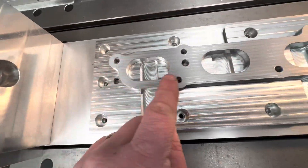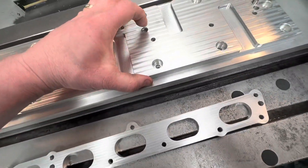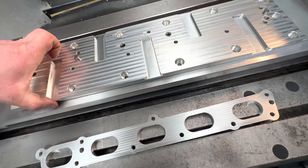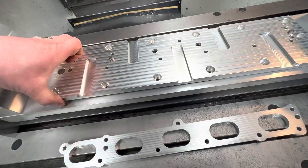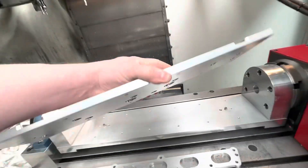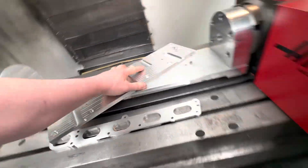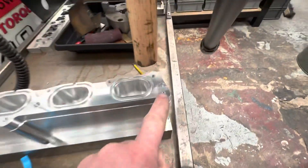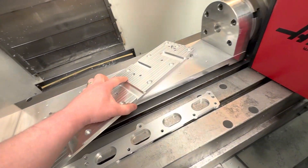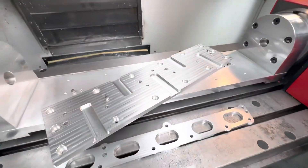You can see that all the holes on this flange line up with all the holes in the subplate. The holes are counterbored for M6 cap heads, plus two larger ones for M10, which will allow the workpiece — which is M6 threaded with two M10 threads — and two holes for dowel pins, to be bolted onto this subplate from the underside. Then the subplate gets bolted to the trunnion table. I'm going to bolt that together now and show you what it looks like.